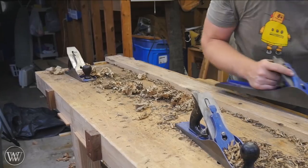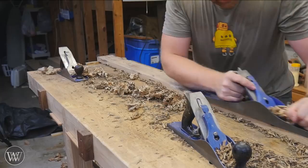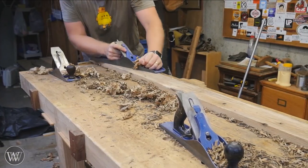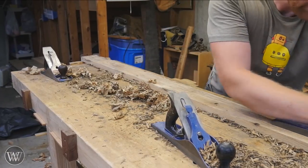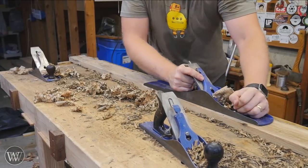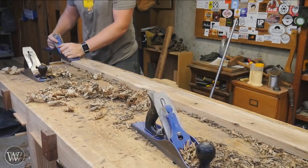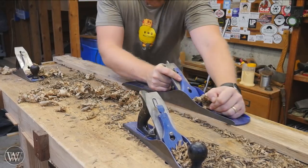So I came in with the scrub plane and then flattened and smoothed them out until eventually I could get with the jointer plane and actually give them a nice true edge. I wanted to give them all a very clean, flat edge on both sides because I'm going to be laminating all of these boards up together to make the tabletop. And if there's much variation in them, you're going to have a problem — and I ran into a problem later, but I'll be talking about that then. So for right now, just do a good job of flattening the boards.